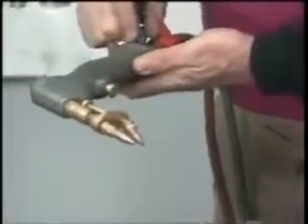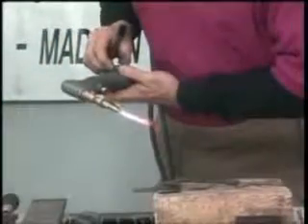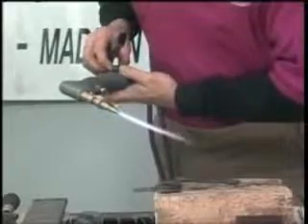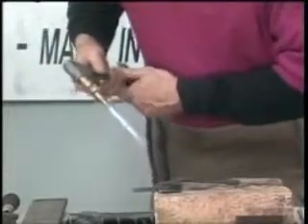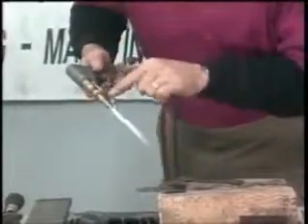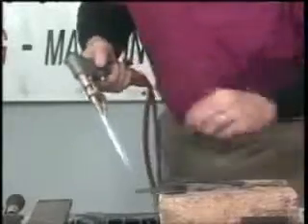So the whole key is to concentrate on your oxygen tip once you start cutting — you must keep that oxygen tip close to the metal. Also, when we cut, we use a neutral flame. If you've got thin metal, just a small, thin flame. If you pull your trigger in and you get a feather right there, just hold it in and adjust it, because you always want a neutral flame even when you pull the trigger.